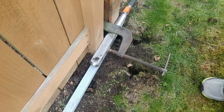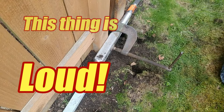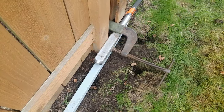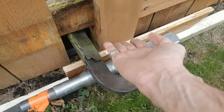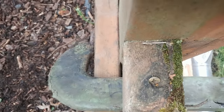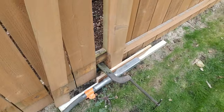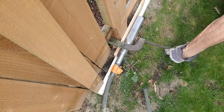What you really need to do is have the fence be the earthquake. So we're going to clamp this vibrator to the post, and that is going to agitate the foundation. But watch what happens to that clamp — it wants to loosen. There's so much energy coming out of the vibrator it's trying to loosen the big clamp. As an improvement, I put spacers in to protect the fence post and distribute the force a little better. On each side I've got a wood block between the clamp and the post. We've got our diagonal brace in place, so we're ready to go — but keep your eye on that clamp, it's really tough to hold tight once the vibrator kicks in.